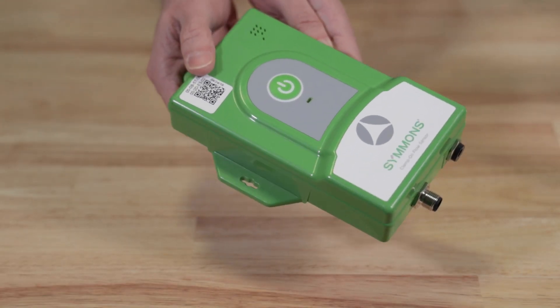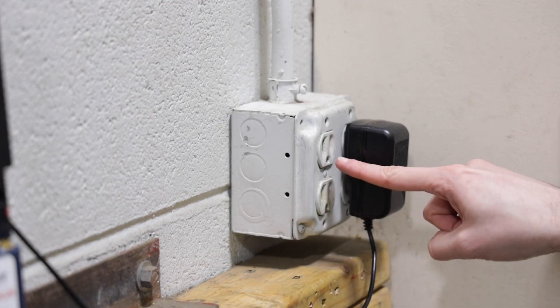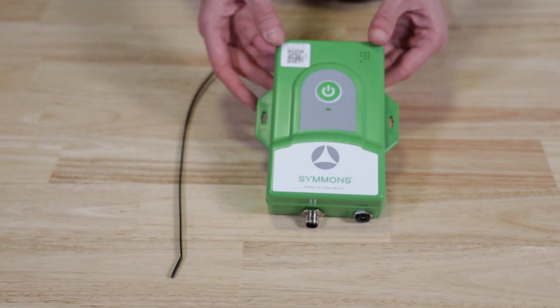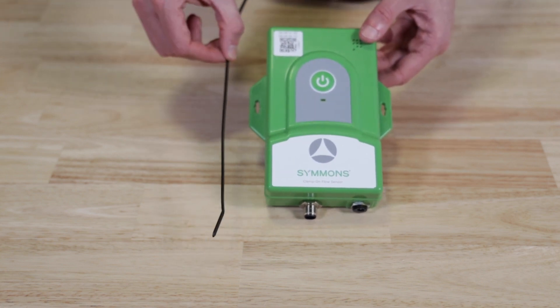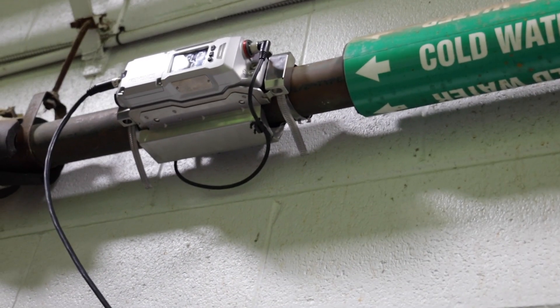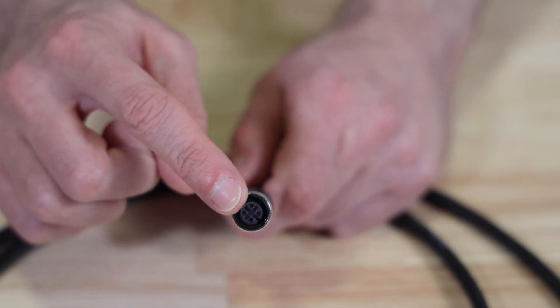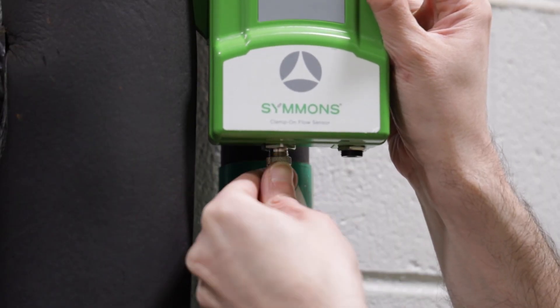Next, we'll mount the green sensor modules. These modules relay the flow information from the sensors to the gateway, then onto the Evolution app. The sensor modules have a 4-foot power supply, so find a good location within reach and try to make them as accessible and visible as possible. There are a few ways you can mount the unit: you can attach them to walls with screws, or you can use cable ties and attach them to insulated pipes, brackets, or hangers. The modules are splash-proof but not waterproof, so make sure they're mounted in a dry location. They also include electronics and small internal antennas, so don't mount them to hot or metal surfaces. The cable from the flow sensor has connector fittings with notches that only allow the fittings to go together one way — just rotate the connectors until they match up, insert, then spin the locking ring until it locks into place.